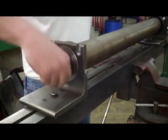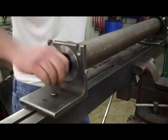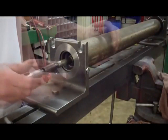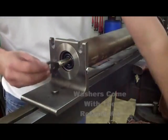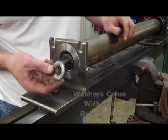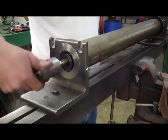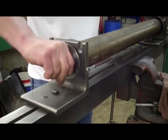These are the same threaded adapters that are used for TruTurf roller bearing installations. Screw in this adapter, or you could speed up the process by using an Allen socket with an impact wrench. The rotary seal needs to be pressed onto the shaft. Use the washers that come with the rebuild kit for the third gen Toro roller and place them next to the rotary seal. Put the adapters back on along with the installation tools on each end and tighten until the components are pressed onto the ends of the shaft securely.